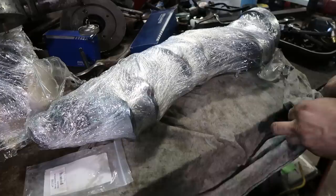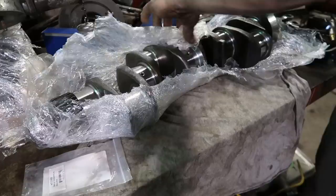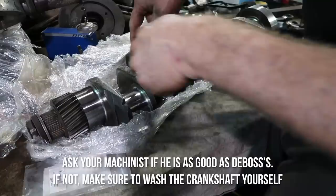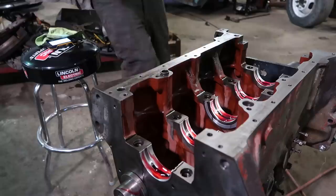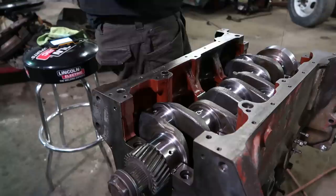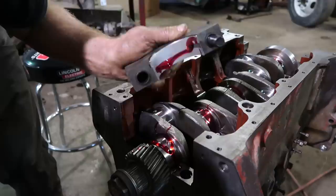You can put a little bit of oil on the inside of the thrust washers — the only purpose is to hold them in place until you have the crank in. You can use grease as well. It's a brand new crankshaft. Make sure not to hit the journals. I don't have to wash it because it's been washed twice, thrice. Double-check, triple-check that all the oil galleries don't have any shavings. Plastigauge that bearing — tighten it down and check that everything is within spec.